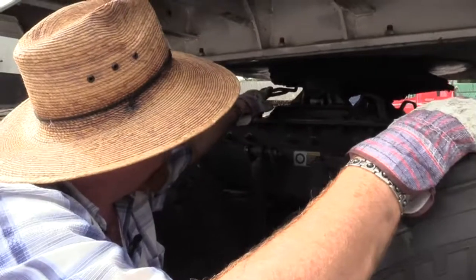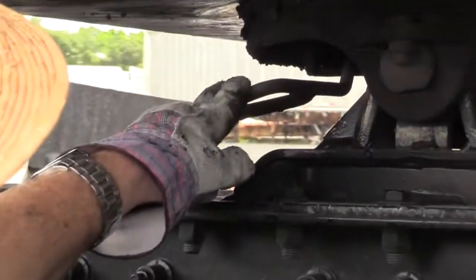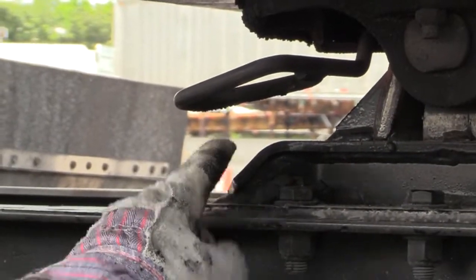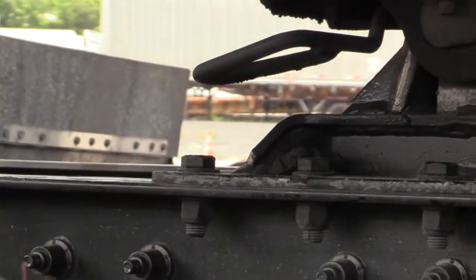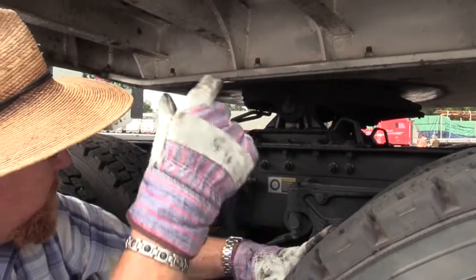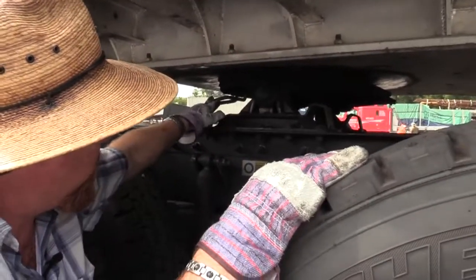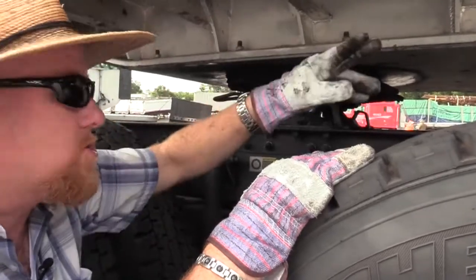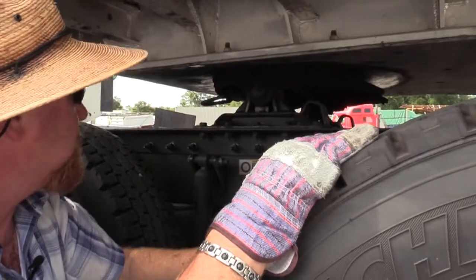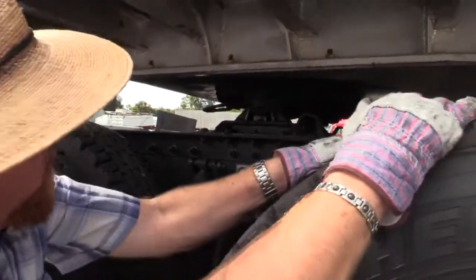Here's your release arm so you can drop your trailer. Make sure that release arm, you can see where it connects in there to an actuator. Make sure you have a good securement at the actuator, and there's a cotter pin in there to keep it from pulling out. Make sure this arm's not bent or cracked. And since we're hooked to a trailer, this needs to be fully engaged in the locked position, and it is. Now, if we were to go up under here,